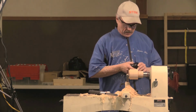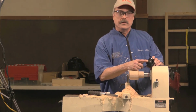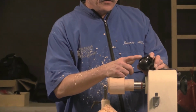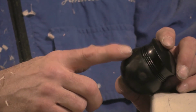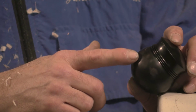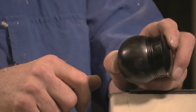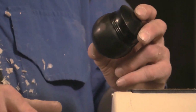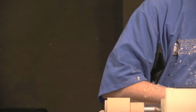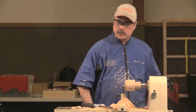But I keep this because this cut down the side is done with the burr completely honed off of one of our tools. And you'll see there's 3 different scratches that I did with sandpaper. One is 400, one is 600, and the last one is 1,000 grit. And you'll see even the 1,000 grit scratched up the surface. So this is the actual cut that you can get off of the tool if you hone the burr completely off. That doesn't work for our local big leaf maple or some of the other woods, but for the really hard, dense, exotic woods and for the acrylics, it works great. This isn't a joke. This is actually real. It's weird to see 1,000 grit scratch up a surface off the tool.